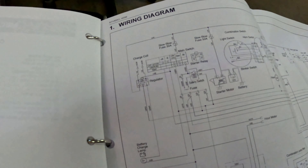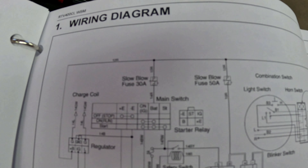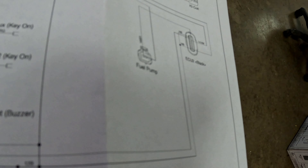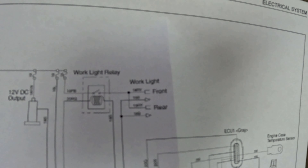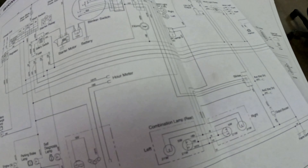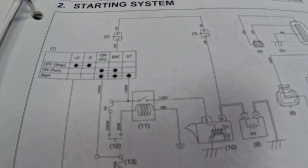I want to come here and take a look at the schematics — it says 'safety switch' right there, and that is one of the relays. As I browse across, the only other one is right there, and that says 'work light relay.' So in looking at all the schematics, those are the two. You may be able to swap the relays with your setup.